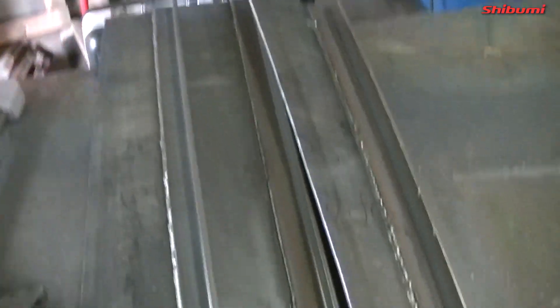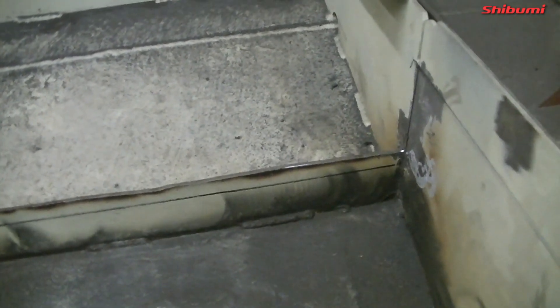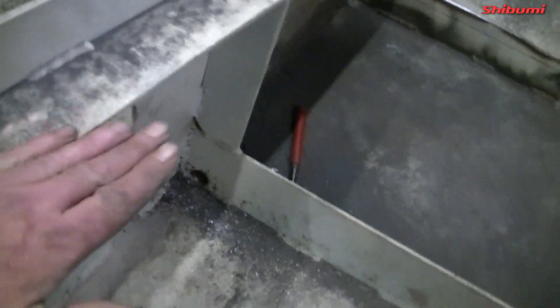All four of them are now welded both sides - welded on the inside, which I'll sand back ready for paint, and on the outside a full seam which will be visible, and the tank top will sit on top of this. This is just one part and that's the other part of the starboard side, and that's where the new pieces I've just made are going to sit in. You can see the little line there - that's the upper side, the top part of a new piece of flat bar that'll be welded and seamed up as well. The tank top will sit right across that.